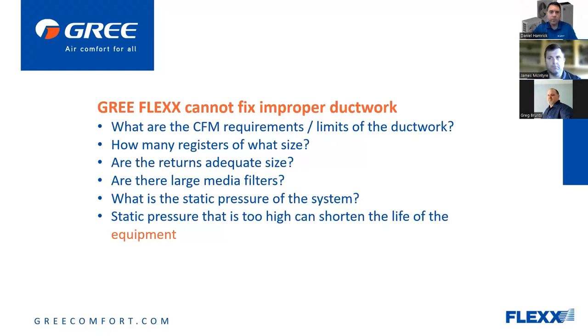In high humidity areas, a lot of times they would set them at 350 CFM per ton. With the Flex unit, 400 CFM per ton would be the max — we don't need to go over that. 350 CFM per ton is probably more the sweet spot; we could even get down to 325 CFM per ton and still be okay. When setting up your dip switches, 325 to 350 CFM per ton in most applications is going to be the sweet spot.